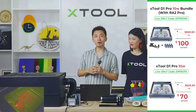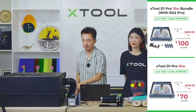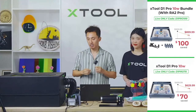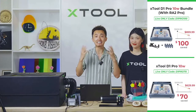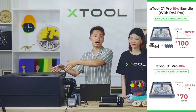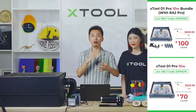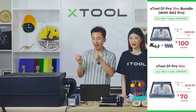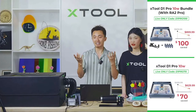Apart from that, we also have air assist. You can see here an air pump, and this is a cable we integrate to our laser module. We want to make sure we have a cleaner and deeper cut, because this brings more air inside. It's because of the process of oxidation of the material, of the metal, of the acrylic. So you bring more air to make sure you get a really clean and deep cut.